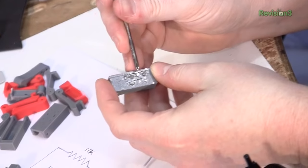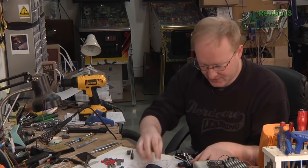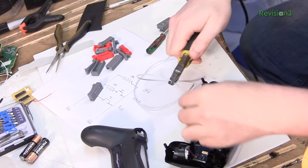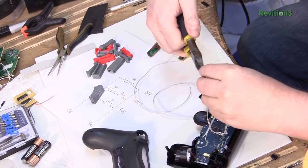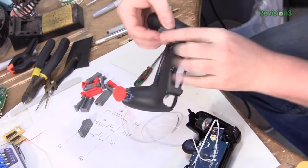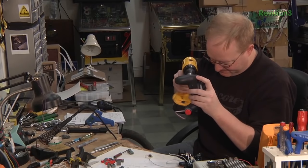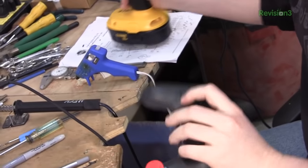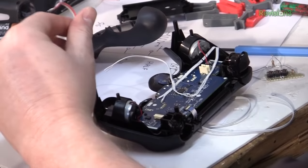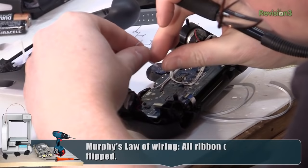I'm using surface mount resistors here so this doesn't take up too much space. These two points I'm going to attach to the controller — I've already ported out that wire, so I'll see what minimal distance I can get away with and cut it there. I drilled the hole through the inside so I could make sure I missed some of the support structure. I've attached the analog stick upside down, so I have to look at my notes to make sure I do this right — you always have to flip. It's like the Murphy's Law of wiring. It's to the point where if you don't have to flip, you think, 'I better check to make sure this is right.' It's that prevalent.